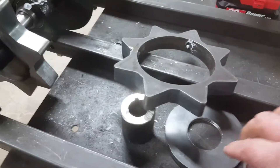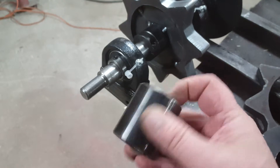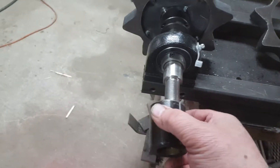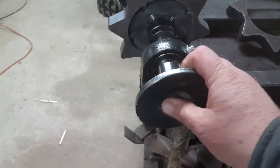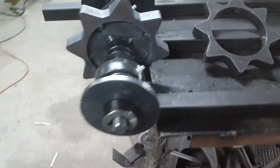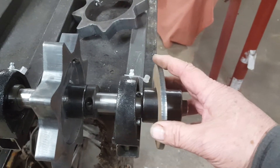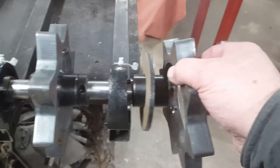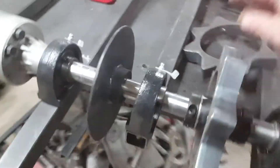I had to make the center hub using half of a four-inch, one-inch slotted shaft coupler. What I did was use the axle as a kind of template — put the hub on it for a really tight fit, lined it up well, and just tack-welded it. I tacked one side, then another, then spun it around to make sure it was straight. I did the same thing with the sprocket — tack welded it — and you can see the little tacks on both sides.